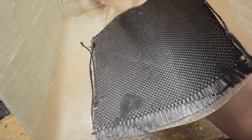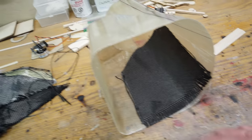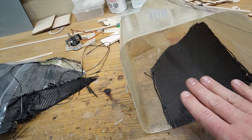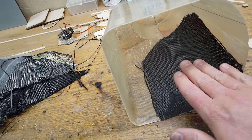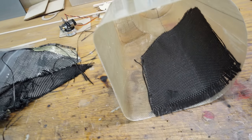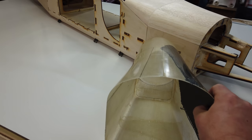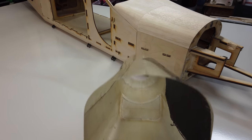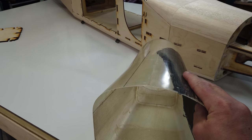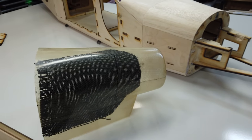The carbon cloth has been installed. It looks quite dry on the inside — once laid in, I take a blue shop towel to remove excess resin, because resin is not the strong part and minimizing it reduces weight. The next day, after curing, it added quite a bit of stiffness to that side with very very little flex in the entire area.